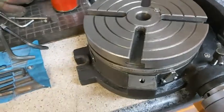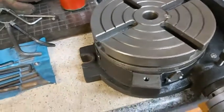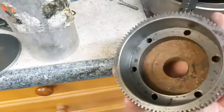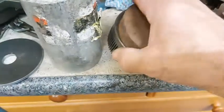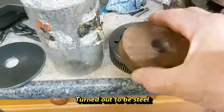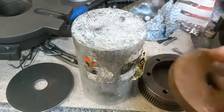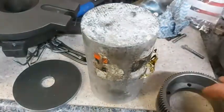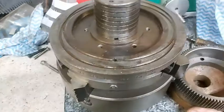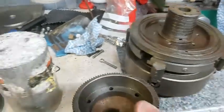Must look for that piece of alloy now to make a spacer and machine up a proper spacing piece. Well, I dug out my piece of alloy bar but as luck would have it, it's too small — typical! Luckily I found a piece of cast iron and this should do the trick. It's almost exactly the size of the worm wheel, just a tad undersized, which won't make any difference. So I'll go ahead and machine a spacer and we should be back in business.